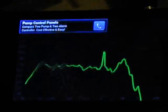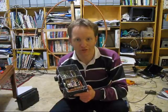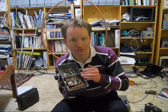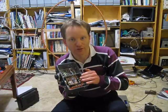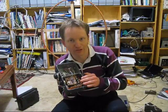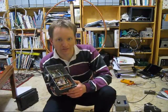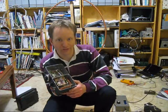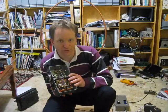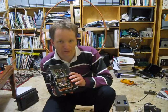I did have to twiddle the phasing control, so it's not quite uniform across the whole audio frequency range. So it's not quite single signal reception, but even a very simple phasing receiver can reject unwanted signals by maybe 20 or 30 dB. It's not great for the competitive DXer, but for the casual listener it is a big improvement over a simple direct conversion receiver that gets no image rejection at all. I'd suggest looking on the web for the Mini Transceiver Project by SP5AHT. It's an incredibly simple phasing 80-metre SSB transceiver, and this receiver is really a simplified version of that. There are some performance compromises, but it's still a pleasure to use, and in the trade-off between simplicity and performance, I think it scores pretty well.